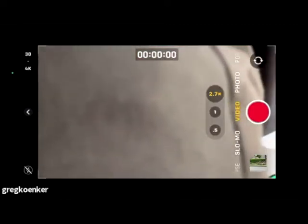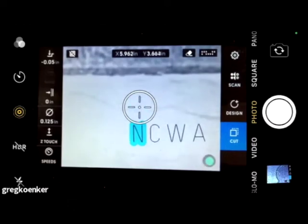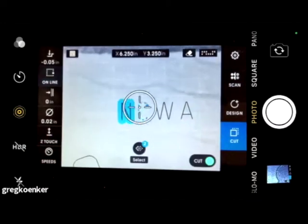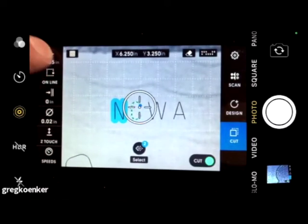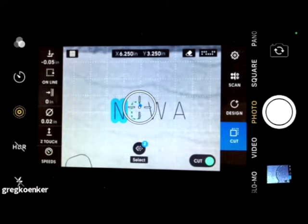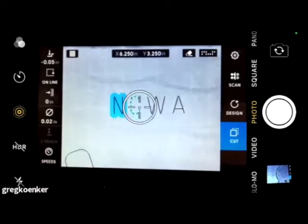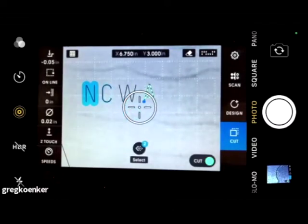So I can go back to this and you can see it's blue. It's cut that with a 1/8 inch bit. But if I were to put it in as an engraving bit, and I'm dismissing the zeroing, you can see now what it will do. I've kept it as an air cut so it doesn't go into the wood, but I also told it that it's an engraving bit, so it's only 0.02 inches diameter where it's cutting. So I've just engraved that C, I should say. I should have an example I can show you here. No, I don't think I do. Oh, well. But yeah, you can do sign work that way very nicely.